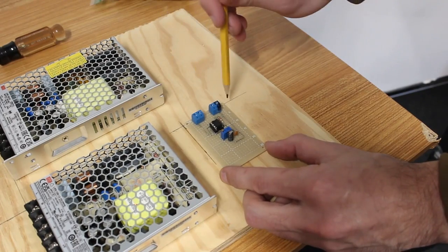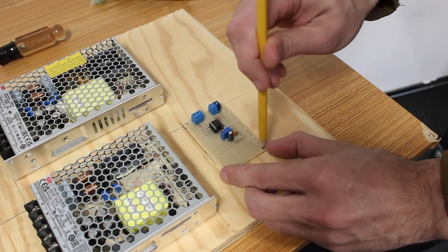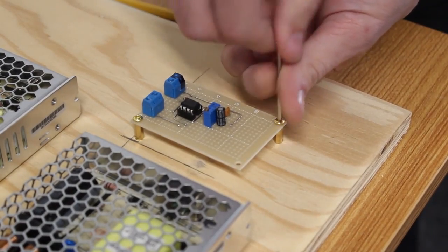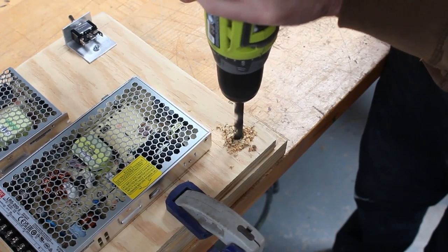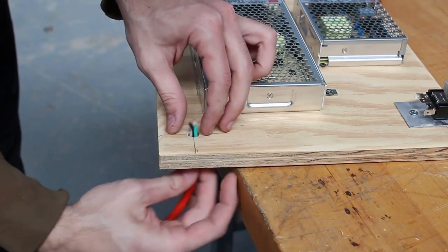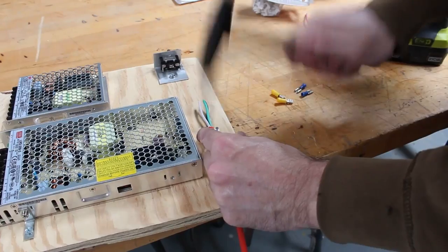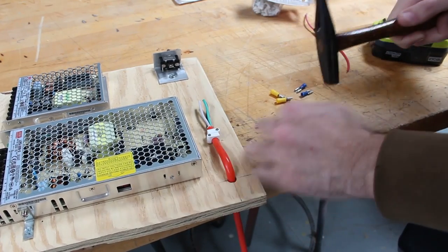With that built up on a perf board, we'll mount it to the power supply board — just measure the holes, pre-drill, and thread in some standoffs. These are actually the same standoffs I use on the tube computer; they work fantastically. Next, let's get mains electricity up to the power supplies. I'll drill a hole for the cable to pass through, then mount the cable down to the wood for strain relief using little clamps with nails and some zip ties for extra strength.